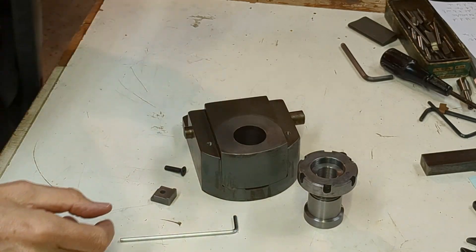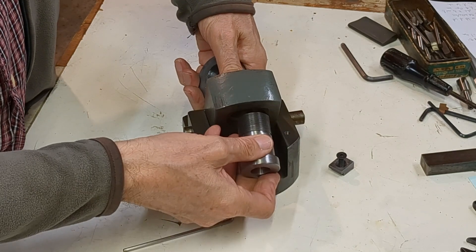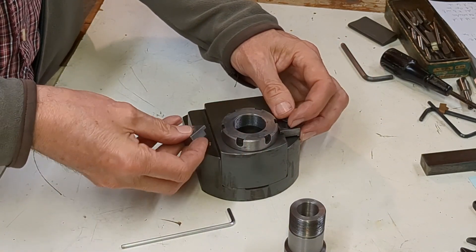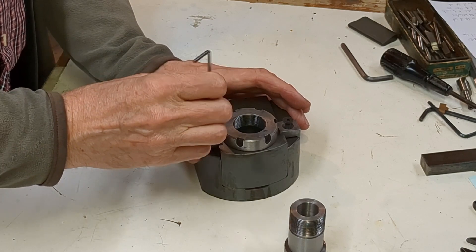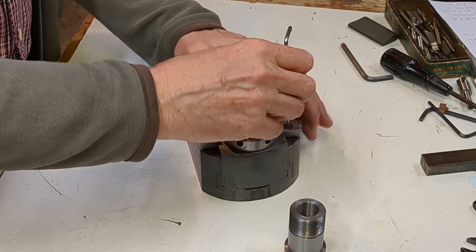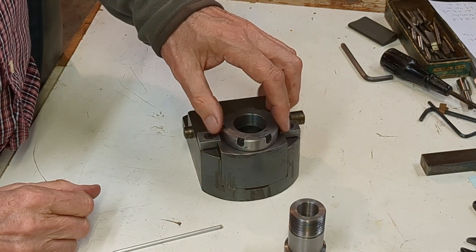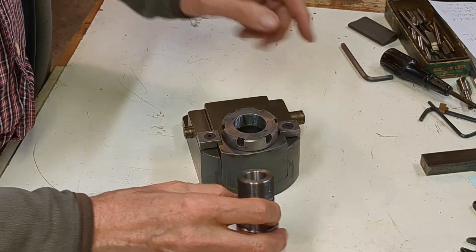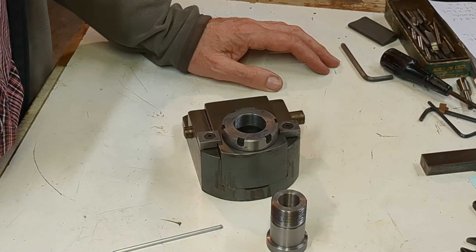That's all we have time for today. We've reached the stage where this comes in from behind, the nut sits on the front, and we have our two clamps which fit on either side of the nut. They're fairly quick and easy to install and they provide a nice rigid clamping force on the clapper box so it becomes one rigid assembly — there won't be any movement. These two clamps and the nut are hardened; everything else will be left soft. I hope you'll join me for the next video where we'll install this, make interchangeable tool holders, and hopefully test it out.